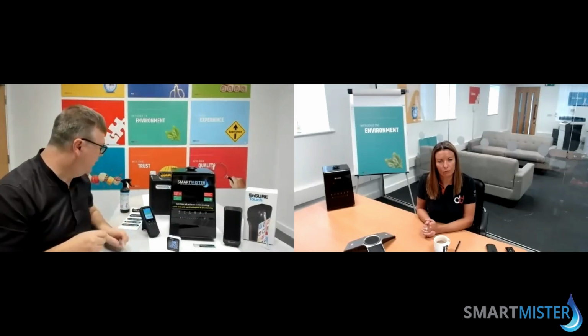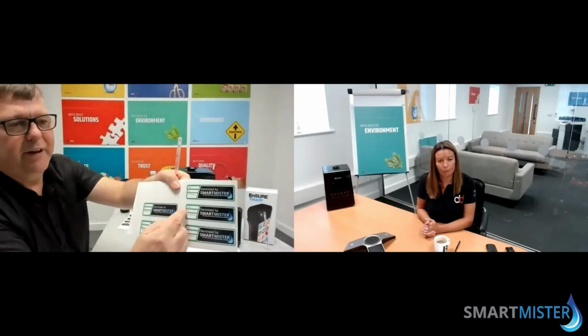So they put this in the room. In their case, they're going to put it on a trolley, wheel it in, set it going. Their room's about 20 minutes of fogging. Leave it for half an hour, say, or whatever time they choose tomorrow. And then they'll go back in, do a test of the air, then a swab test, and then it'll be signed off. And in their case, there's a little sticker, and they'll put the date and time on it for the insurance company to know that it's been signed off. So yes, they can re-enter a room quicker than before, because before you get a legal requirement of leaving it for so many days.